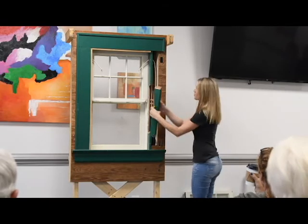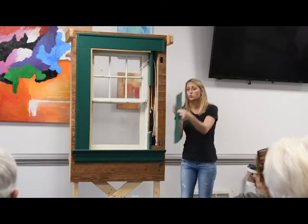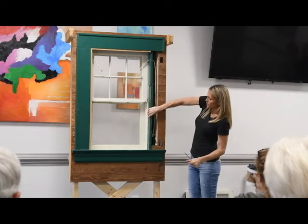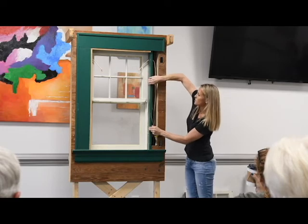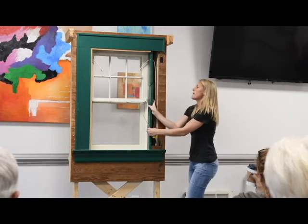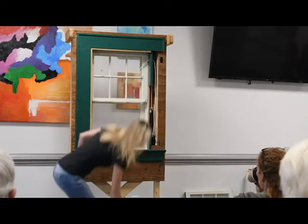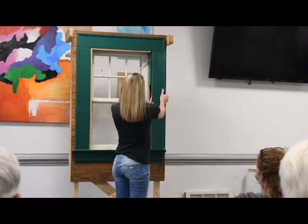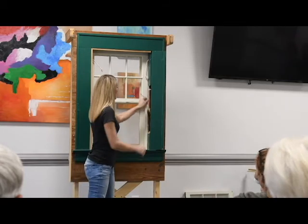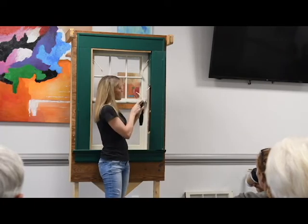All right. So this panel will come out, and you'll notice that it's cut on two different angles here. It's two angles so that you can slide it up like this, and then it rests right like this. You'll put these in and take a screw, and it'll suck that part in. Normally it's just one screw right at the top. So this access panel will come out, and you don't have to take the rest out. All you have to do is reach in and get your weight out, retie it and put it right back in.